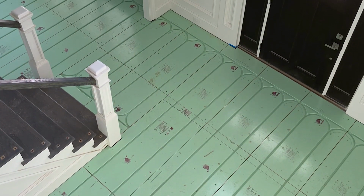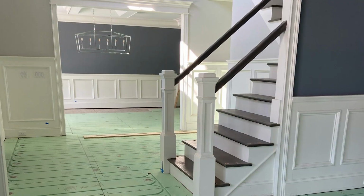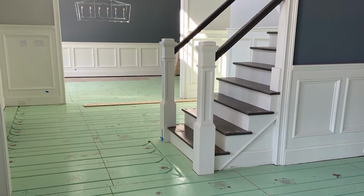If we're doing gypcrete or something like that, the downtime's on the guy from the gypcrete factory setting the floor, pouring the floor, waiting for it to cure. There's no lag time here. We can work right through construction. All trades can work through construction without a problem because the Warmboard panels are so durable and reliable. They don't really get damaged and you don't have to worry about not working on the floor. So 3-4 weeks the old way.